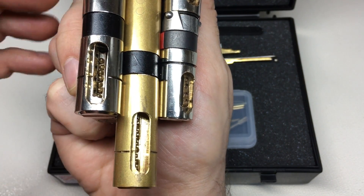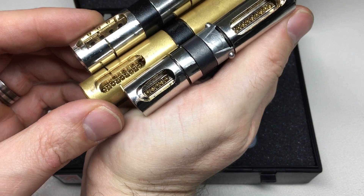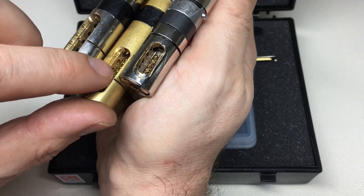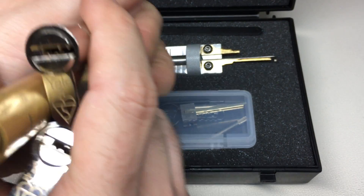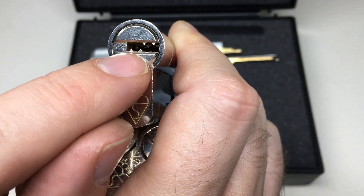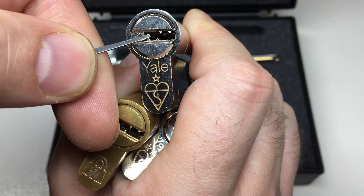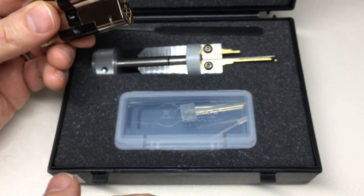When you're picking, the angled pins don't really make much of a difference if you're picking by hand - they're not angled too differently. You can also see here where these have been drilled out where the sidebar pins would sit - these sliders. There are four there, four there, and four there. If you look at one which hasn't been fully disassembled, you can just about see at the top where the slider sits - pointing at it with a probe you can just see the slider there. There are four sliders in this lock.